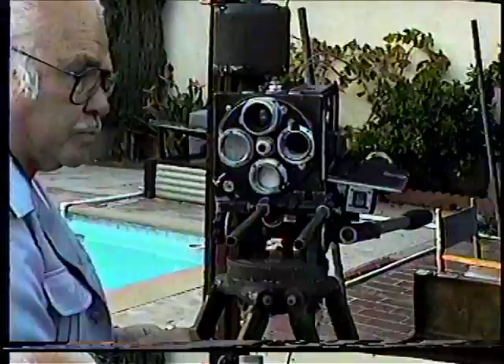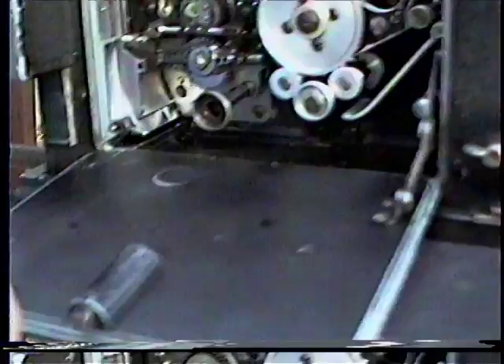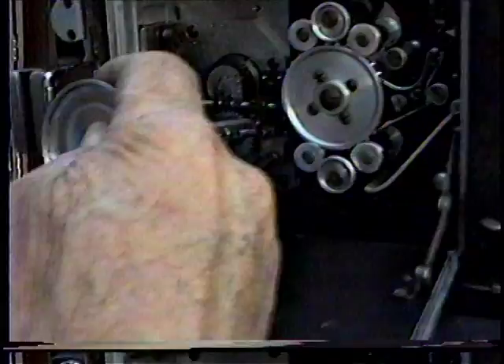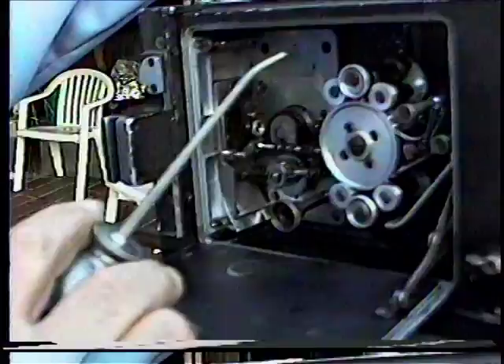Another thing — do you have camera oil? There it is. I'll show you about lubricant — where to lubricate it. In one position, put a drop in here, one drop and a drop here. And then when you put it in that position, a drop here and a drop here. Once a week, put a couple drops. See that felt? There's one in the back — a couple drops. That'll last you a week. We've lubricated all the light oil points, the felt and the two spots there.